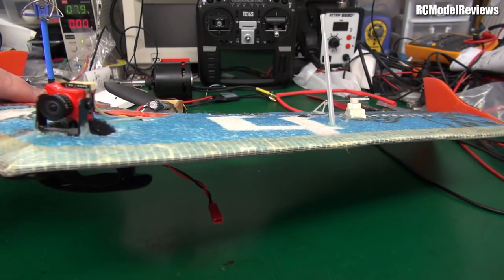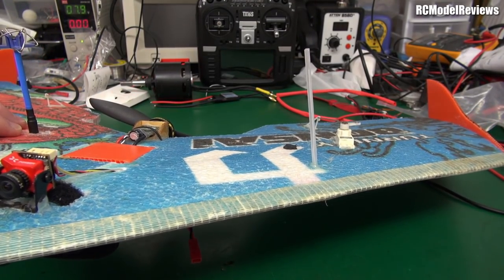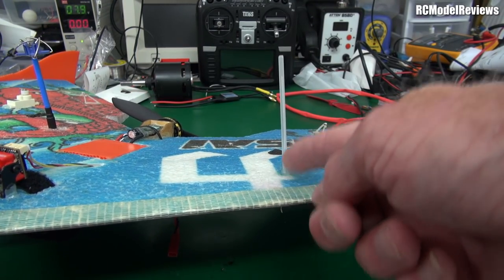Polarisation is a wonderfully interesting thing and a fantastic aspect of radio frequency communications that I think has been greatly ignored from the point of view of our radio links. My long range fixed wing model is a bonsai, and you'll see that I have the receiver antenna in a tube vertically oriented. I run the loop dipole on my R9 system vertically polarised, and there are no RSSI surprises there at all.